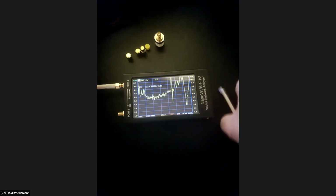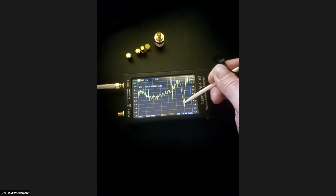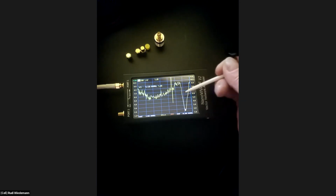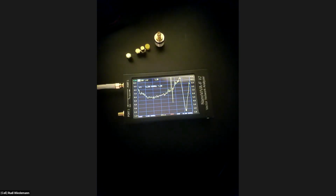All right, so now the trace we're looking at is right here. It just came down off of 10 megahertz and it's coming down. Can you see how that's moving? Now, there's a lot of noise on here because a motor generates a crap load of noise. But let me stop the motor. And now it'll settle out. And now we can see it sitting here at 9.23 megahertz.